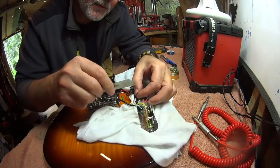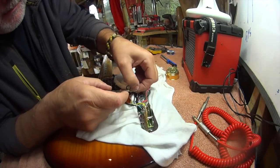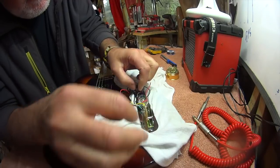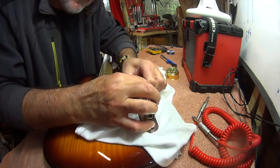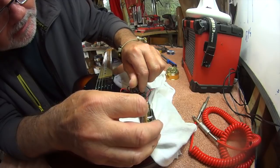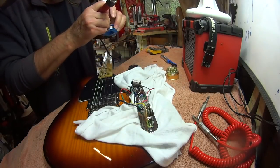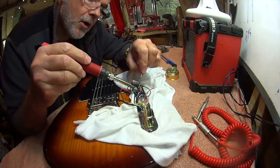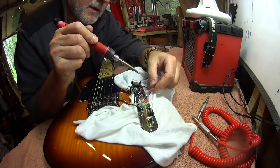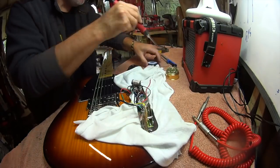So I'm going to attempt a tiny bit more of a splice. I mean attempt. There's tons of pickup wire here just in case we need it, but I'm just trying to work with what we've got rather than make any new things. Okay, so here's a little, tiny little thread of wire. It's very, very small. Let's tin this a little bit to keep it at least stiff enough to get through the hole. Let's tin that as well for good measure. Just keep the ends together.